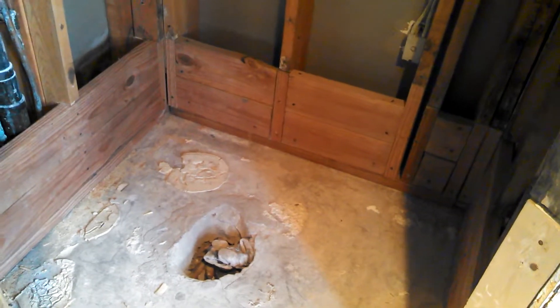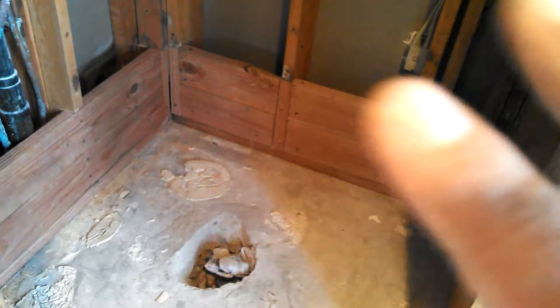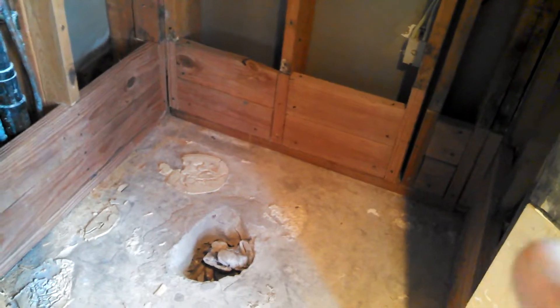Then I'm going to put the plywood in here. I'm actually going to run that rubberized skirt up underneath and put the sheetrock against that — not in front of it — because I'm going to be tiling all this, and you can't tile rubber.